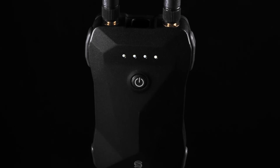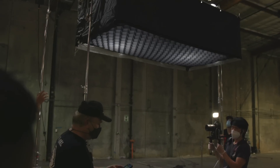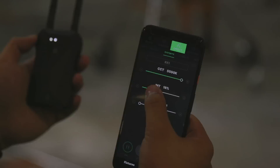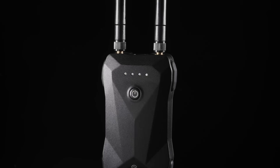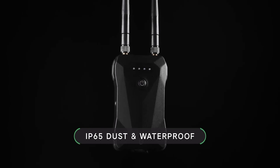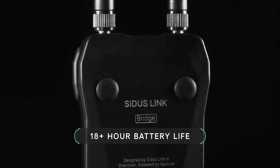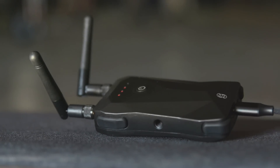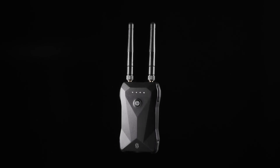Finally, if your light doesn't have Bluetooth, don't worry — we've still got your back. With Sidus Bridge, even older Aputure lights can be connected to your phone. You just need a fixture with remote control, and Sidus Bridge acts as a translator, converting Bluetooth into a standard 2.4 remote control. With an IP65 dust and waterproof design, Sidus Bridge is built to last. On a single charge, one bridge will last over 18 hours and can be quickly charged via USB Type-C. And for those that already have Bluetooth, Sidus Bridge acts as a signal amplifier, extending your connection range across your entire set.